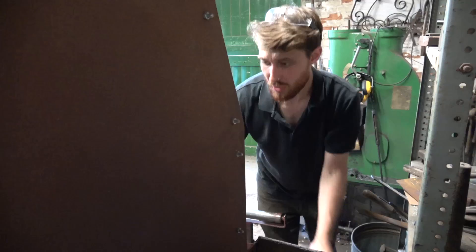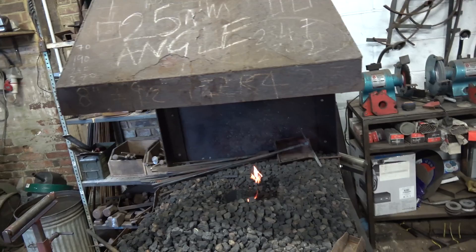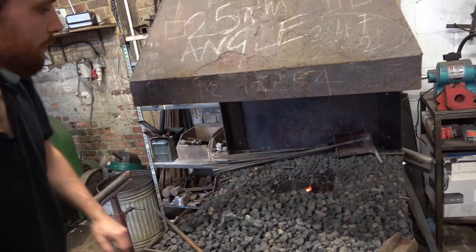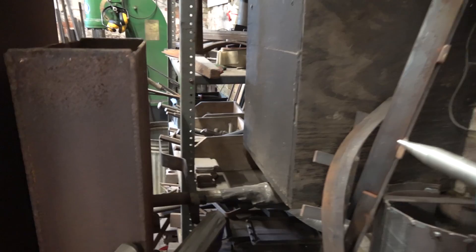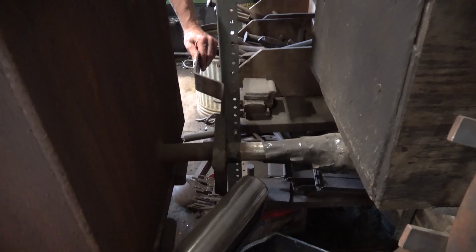So let's get going and enjoy ourselves. These old English style ones are much easier to clean out as you're running, but with the bottom draft ones they have to really kill the fire to be able to get it out, because your blast is coming straight in level at the back. Yeah, there's a blower - a bouncy castle blower in that box - and then a sort of sliding gate to choke off the air as required.